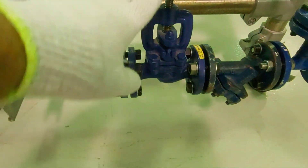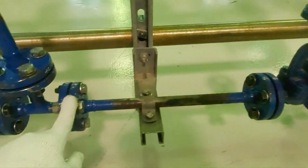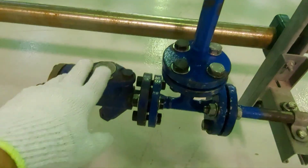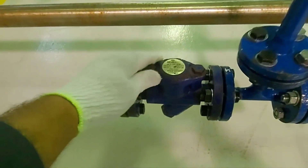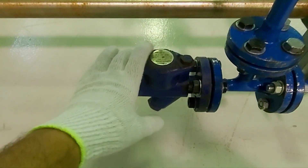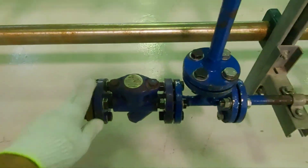Again a globe valve. This is a flange — all components will have a flange to connect. Then this is a T, and then this one is a condensate drain, or water separator. Basically what it does is remove water from the fluid.